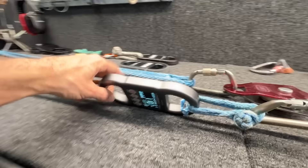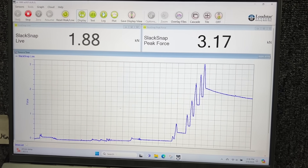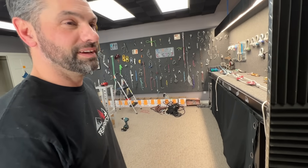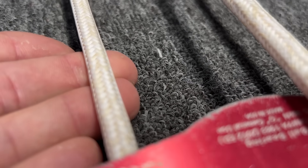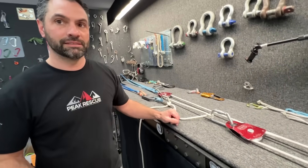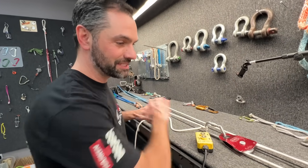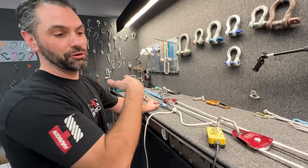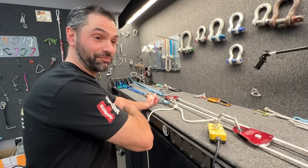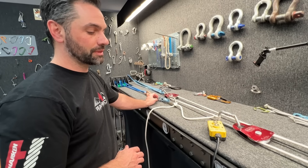What happened? There's your numbers — peak force one. You've got pulleys here, so it is a mechanical advantage only when you have high-efficiency pulleys. Does it hold when you have high-efficiency pulleys? No. That should not be happening. So this entire thing is built on friction, and friction stops your mechanical advantage. Winner winner chicken dinner — mechanical advantage is there, but this system has nothing to do with mechanical advantage and everything to do with needing high friction to maintain tension. So much friction that it destroys your mechanical advantage — it takes a three-to-one and turns it into a one-to-one. Exactly.